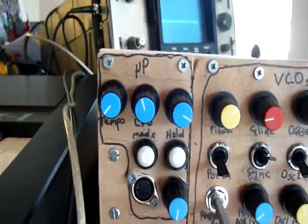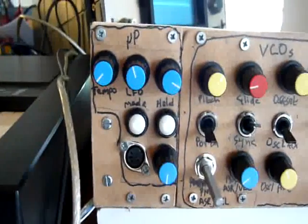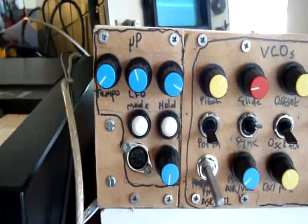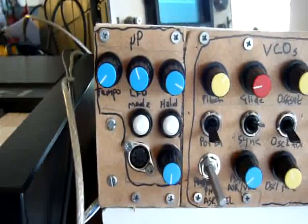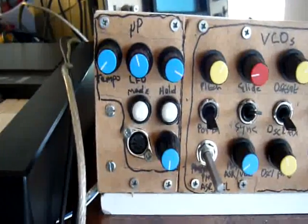We've got the middle knob there controlling the LFO frequency, and the right knob which controls how the LFO gets mixed into the velocity control voltage, which essentially allows the LFO to be routed to filter cutoff or PWM, other things. Now you've got some buttons there which initiate various modes.